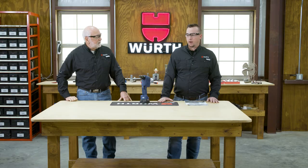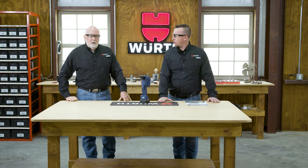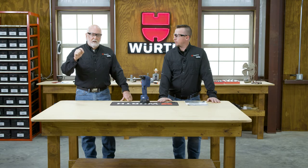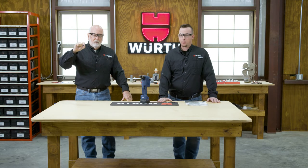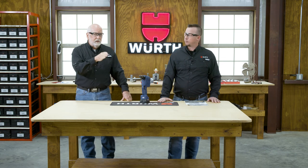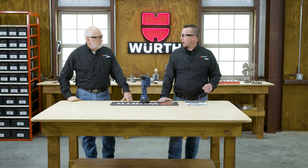Exactly right. And another common one I've seen is a loose set. A loose set typically tells us that, again, your hole could be too large. That can certainly cause a loose set. It's got to expand out. Again, think of oblong holes too. The other thing you have to realize is your thickness of material. If your material is too thin for the size rivet you chose, sometimes you can get a loose set for that reason because it doesn't pull up right. Right, and maybe a solution there is to go down in size on the grip range.